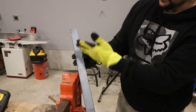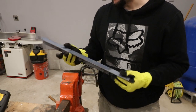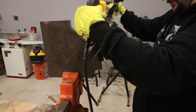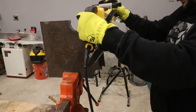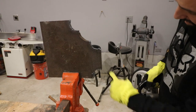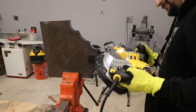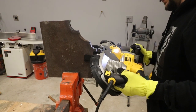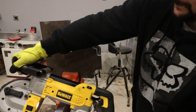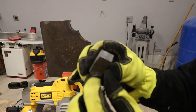Look at that — just nice square ends. I realize this is basically scrap with all these plasma cut marks in there, but that is going to be such a valuable tool for me. I'm going to put this thing to the test and try and cut off a big hunk of this. I've done about an inch and a half in maybe 30 to 45 seconds. Just super nice, super clean, super efficient. The comparison between a plasma cut edge — you can see here this is oxy-acetylene — that's just beautiful in comparison.